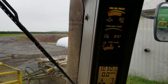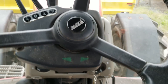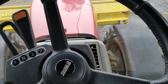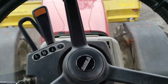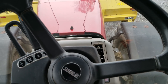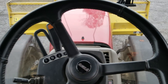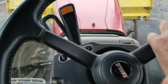So you can see we're about three-quarters of the tank — not quite. We're going to fill her up. The first thing you want to do is push your clutch in and go ahead and go into forward. This is a shuttle shift, so when you're backing, all you've got to do is go to neutral, back to reverse — no clutch — then forward. Run a little bit more RPMs; I use around 1,500. Back to neutral, forward. That's how it works — pretty smoothly. So we're going to pull up here and fill it up.